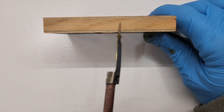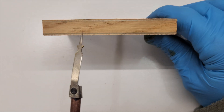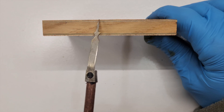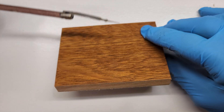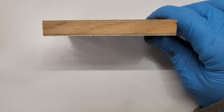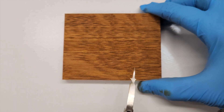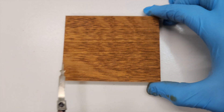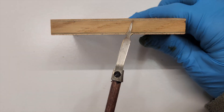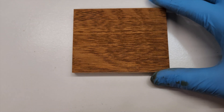We've got our core wood, or the actual structure of the piano. In this case it's oak. Then we've got a middle layer — that's our cross banding — that runs this way underneath. The cross banding helps reinforce the veneer during seasonal changes. And then our veneer surface, which is what shows on the piano. In this case it's quarter sawn oak, and of course that grain runs this way. So you've got three layers: the core, the cross banding which runs this way, and the outer layer — what we see when the piano's assembled — the veneer.